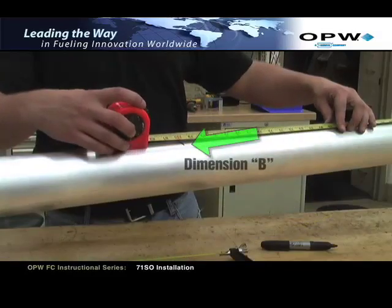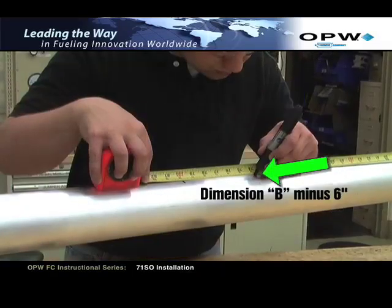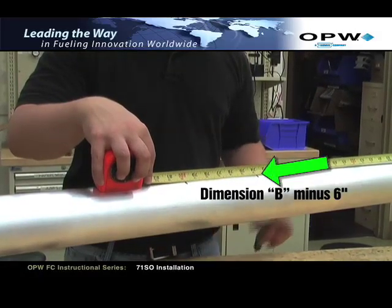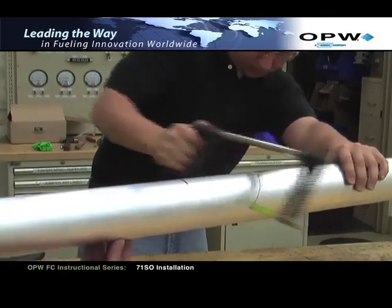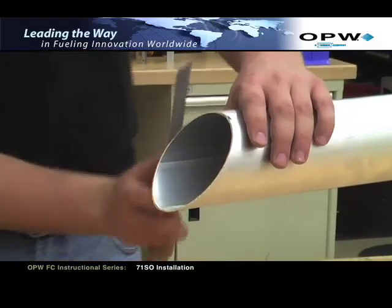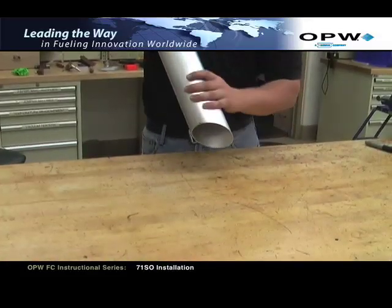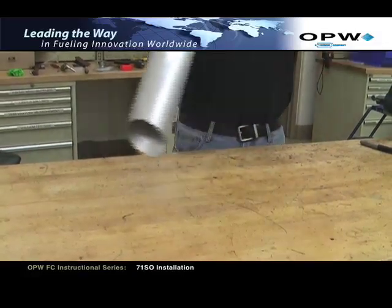From this mark, subtract 6 inches. This mark on the tube will indicate where you should begin your cut. Cut in the direction of the bottom of the tube at a 45-degree angle, or per local codes or requirements. File off all sharp edges or burrs. Remove all shavings and chips out of the cut end of the tube. Do not remove chips by dumping them through the valve body.